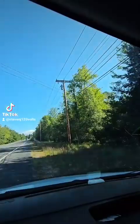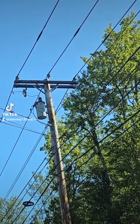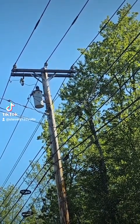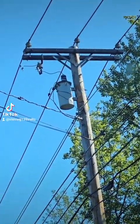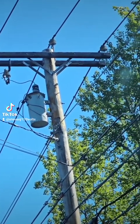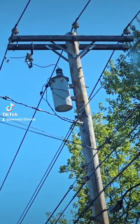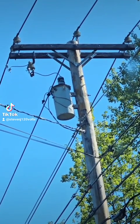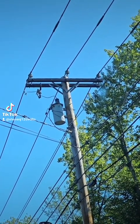I'm in the car now just because the traffic was so loud. You see the three wires on top? Those are the primaries. Each one of those is a phase — that's A phase, B phase, C phase. I don't know the voltage, 7,000 maybe. But we only put 240 into a house, so before we put any of that high voltage down into a home, we have to step it down in a transformer. They tapped off of only the far left phase, and then it's a three-wire triplex that goes off to the house — fed off of only one phase. That's why it's called single phase. The transformer only taps onto one phase. If it was three-phase, it would tap onto all three.